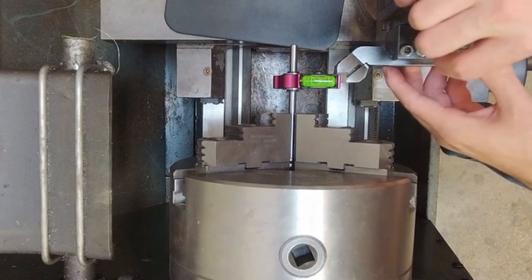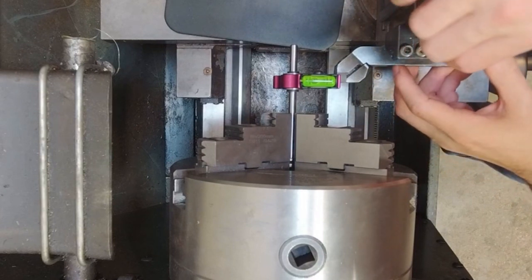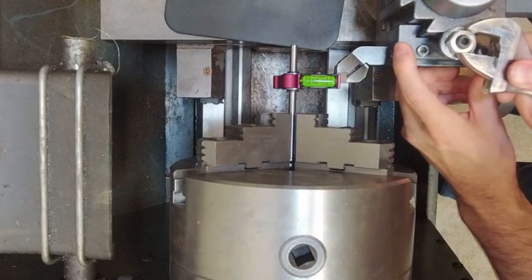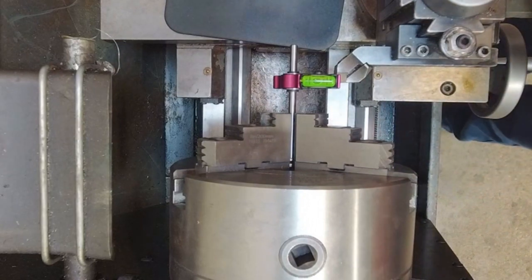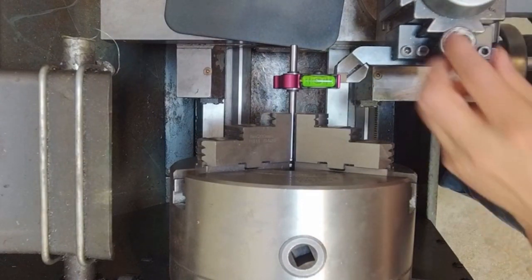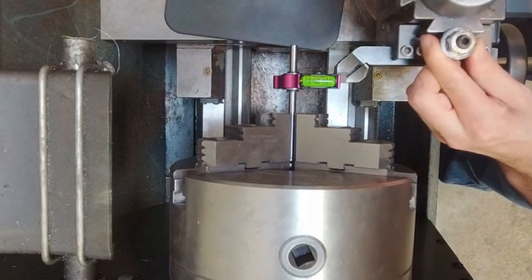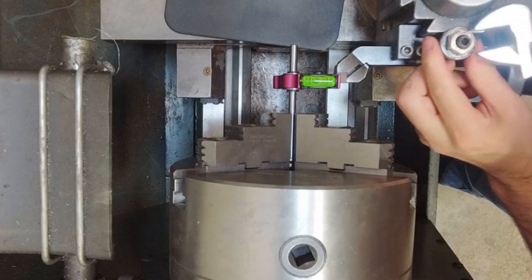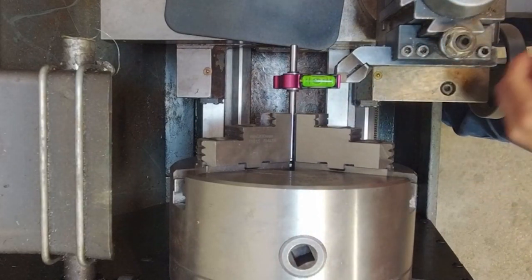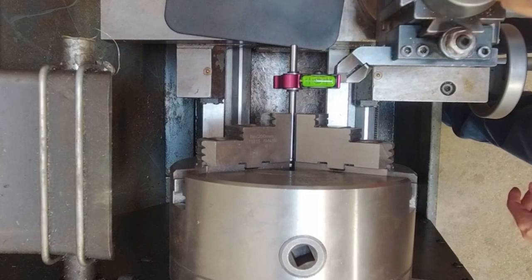So the process is still a little bit finicky, but we're at least working to a more known point in space in terms of the height of the tool, instead of chasing cut tests with the pip at the end of the part or indirectly inferring the tool height based off of the movement of some shim stock relative to the part or the tool. So we're kind of constrained, I guess, in what we're chasing. And in a perfect world, tool setup is done minimally. But in a shop like the generator, where people need to use tools on and off in different ways, having a tool that makes setup and re-verifying tools easier is going to make life a little bit easier.